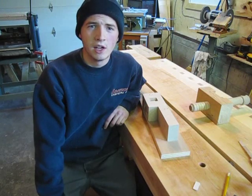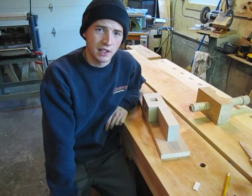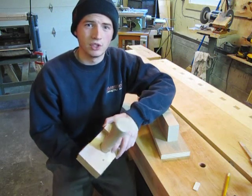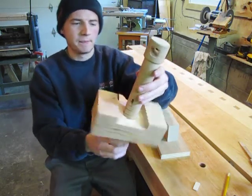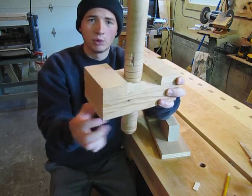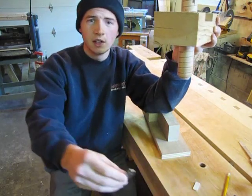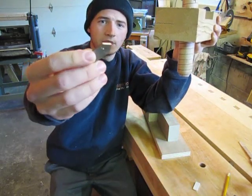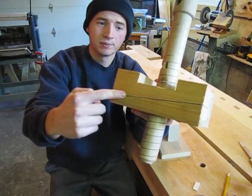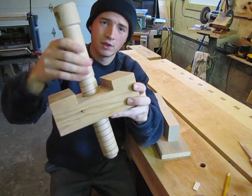In the next video I will start work on the tap, but to finish this video I'll show you what the tap and screw jig I'll be making looks like. These are for two inch diameter screws, though I'll be making one inch diameter screws. This tap makes two teeth per inch threads. You can see the dowel of the tap which will be turning on the lathe, the hole which we will be chiseling out, and the hole that houses the metal cutter we'll be making from an old file. There's also the sheet metal inserted into the kerf, which pulls the dowel through the hole.